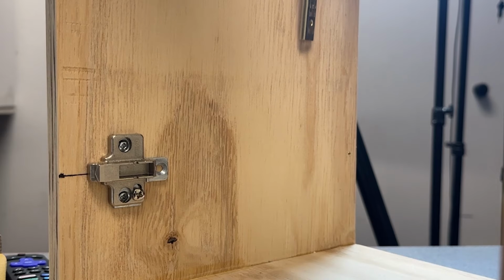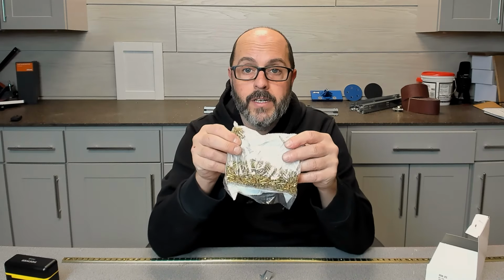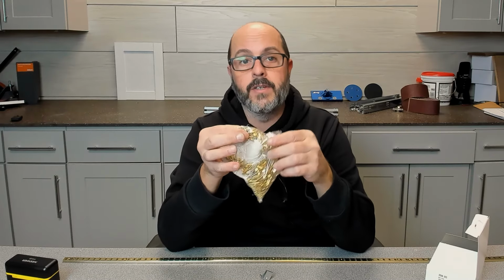You simply take the 4 pilasters that you ordered and line them up on the inside of the cabinet or on the wall. I personally would set them back about 1.5 inches from the front and the same 1.5 inches from the back side. This allows plenty enough room for you to either screw or nail these into place. Now, we do sell nails for these pilasters that match color-wise. This is the brass, it matches the brass. All the different colors if you want to use the nails, or you can just use screws, especially if you're going into the drywall.